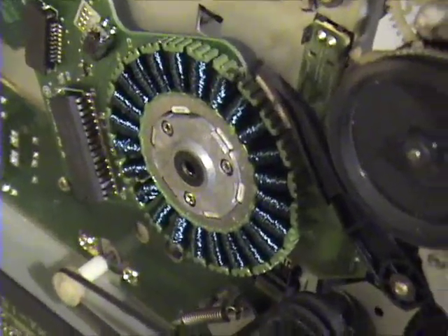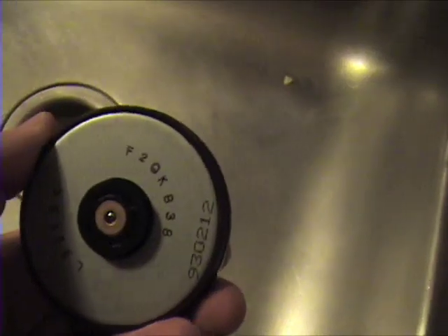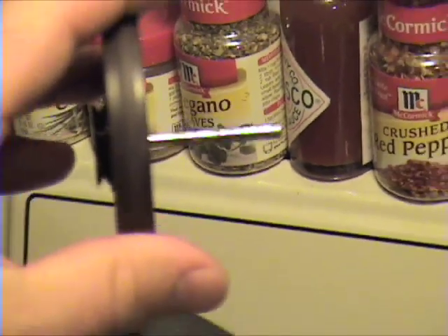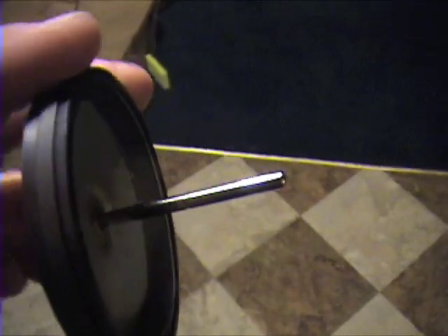As you can see, I've removed the capstan motor — the flywheel. Here's the capstan motor, pulley, and magnet flywheel. And as you can see, the capstan is badly rusted. I wish this camera had macro, but it doesn't. A total transformation — turns out what I thought was corrosion and pitting was actually particles from worn-out tapes. I was able to get the capstan to shine like brand new. I found it was easier to remove the transport from the housing.